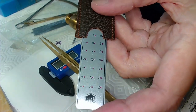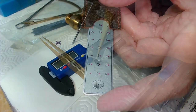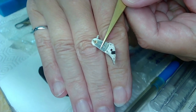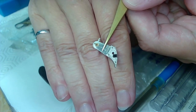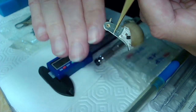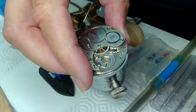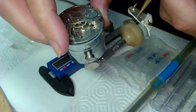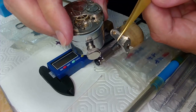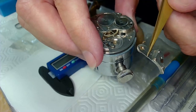I'm going to have to take the movement out and use a pin gauge to measure the hole size — so you also need pin gauges. If you don't have pin gauges, you can use the upper balance cock and the jewel in there to determine the size of the pivot you need to make. You also need to use the lower plate to make sure it fits as well. You can actually use these on the lathe when the balance staff is being cut to fit and look closely to see if it fits properly, but my recommendation is to buy some pin gauges to measure the jewel holes.